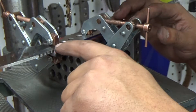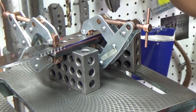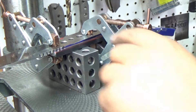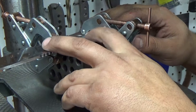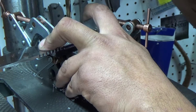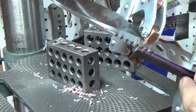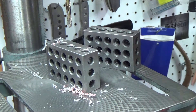If you have a better method of fixturing it and putting this whole mess in a vise, that is the better way to do it. This is the way I do it for now. The nice thing about removable handle scales is I can go back and refinish everything. If you're worried about scratches, you can put a little tape down. I'm going to go ahead and drill the two holes for the screws and the third hole for the lanyard. When you do it this way, you've got to hold it down nice and tight. You probably can't see with my hand in the way, but I'm kind of peck drilling. One way through — we got our first hole done. Now, if you have to reposition the clamps, your best bet is to take either a quarter-inch drill bit or one of those standoffs and put it down in that hole. It'll save your spot and you don't have to worry about misalignment later on.